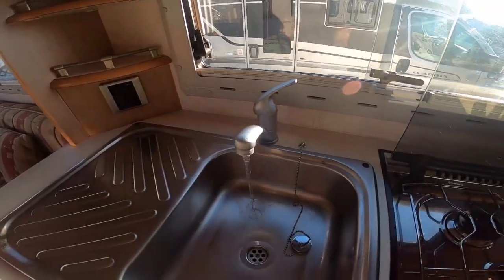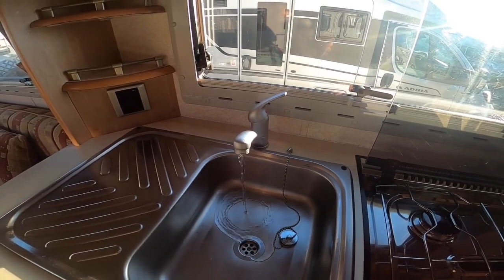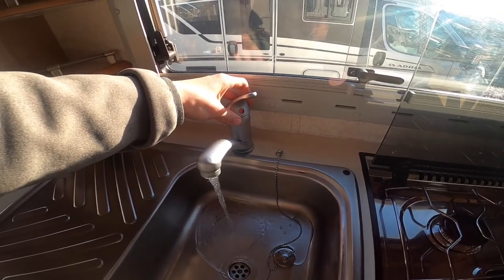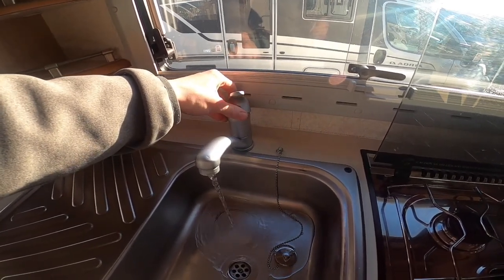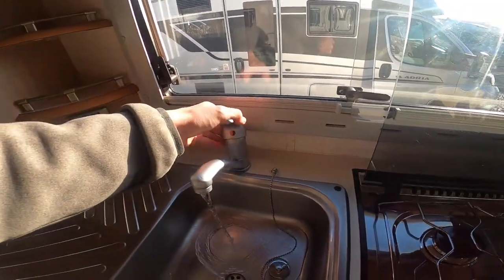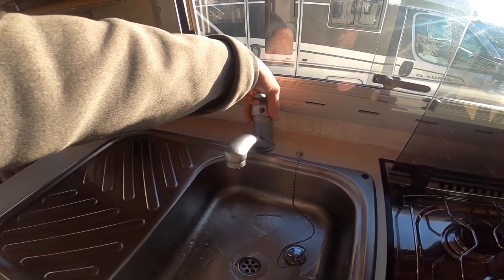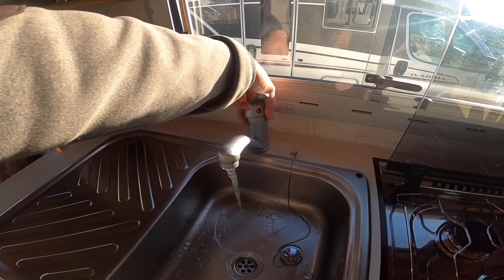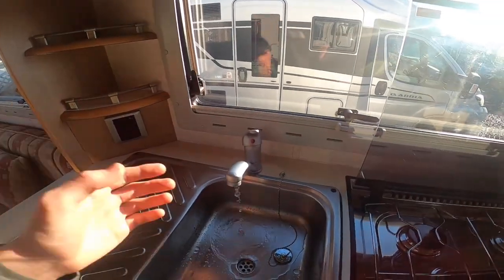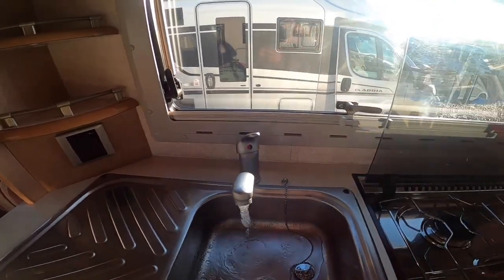On the cold side first when filling the boiler — you'll get an automatic pressurised flow of cold water. Then slowly start turning it round to the hot side as it's pushing the air out and the flow will improve. You may get a lot of sputtering, so just turn it back and slowly start turning it round until all the air is gone and you get a pressurised flow from the hot side of the hot tap.